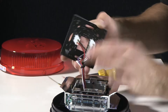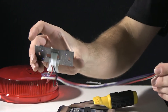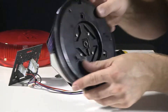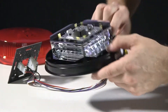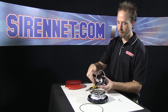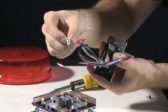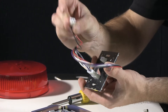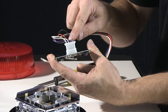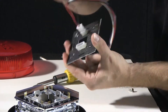You can see this is where your wiring harnesses connect in, so I'm actually going to go ahead and pull the whole harness out. With the top assembly removed, there's a base opening for your harnesses to go through the grommet. On the back portion here, two harness quick connect points. The lead and grounds is the red and black wire here. Your beacon's control wires are these four here. You have a sync, a high-low, a pattern default setting, as well as a scan lock for changing your beacon's patterns. Again, quick connect for the harness.